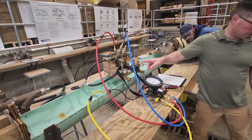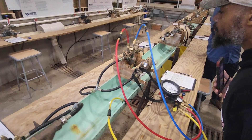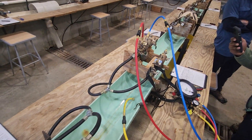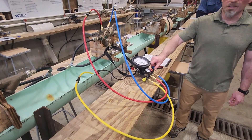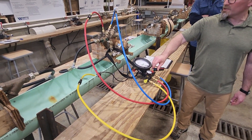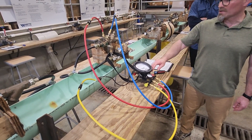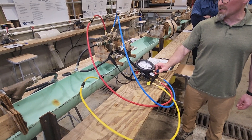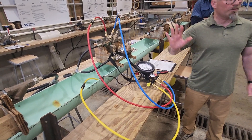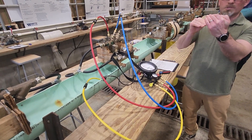Take a quick look — that's what it should look like: drip, drip, drip. It should not be more than that. We opened at 2.6. If you keep going and open it too much, it looks like your backflow is failing — but no, your procedure is wrong. You want to open it just enough to get that nice slow steady drop and then leave it. You don't have to keep opening it. You're waiting for that zone pressure to come up, and at some point it will push open the relief valve nice and slow and give you a steady drip.